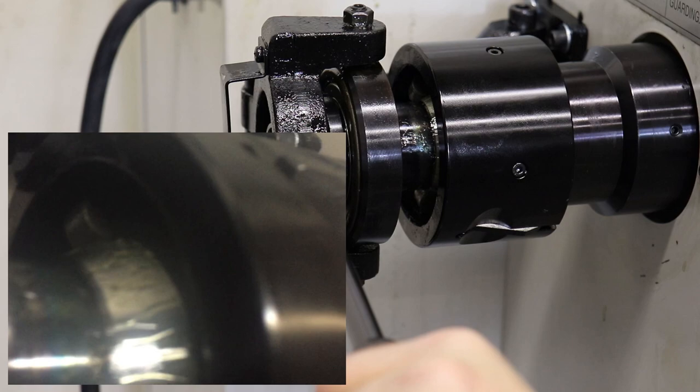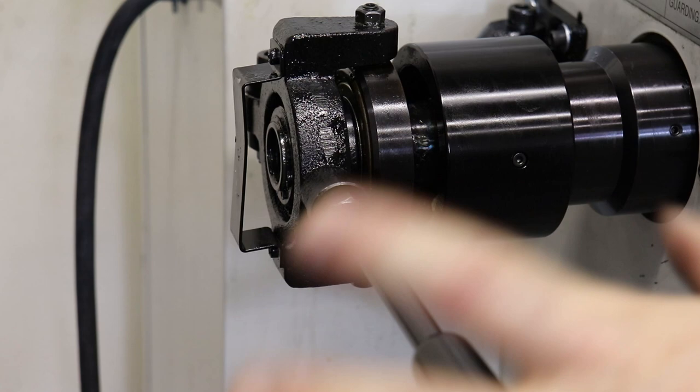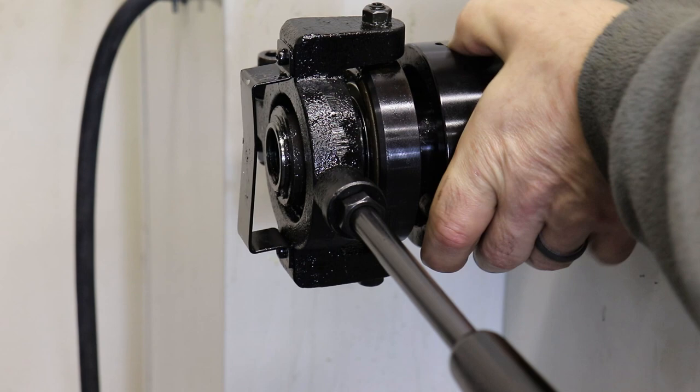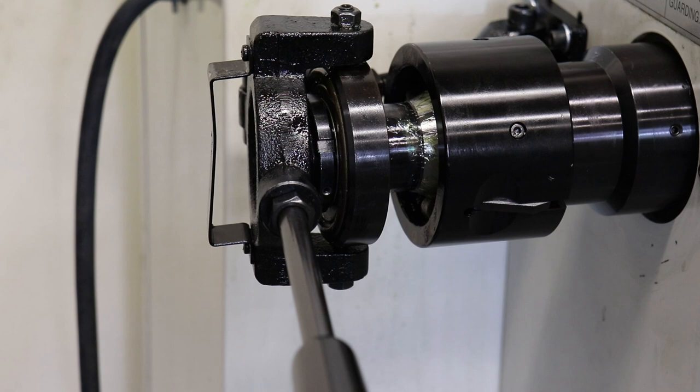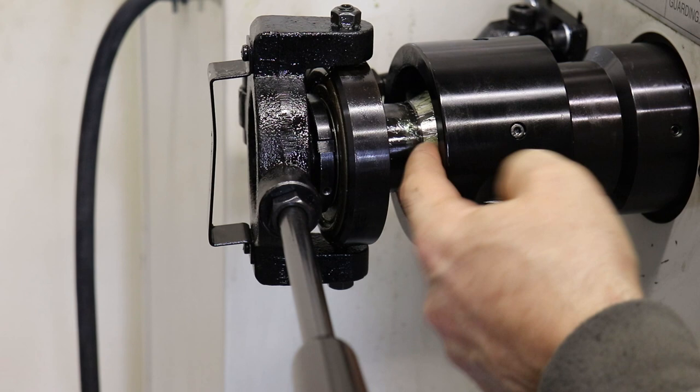So now I'm gonna pull it in a little, and then loosen the draw tube a little bit, and then I'm basically feeling for the right feel and sound. So let's see what happens. So that was too loose. So let's tighten up the draw tube a little bit. And there, that felt pretty good. And you can hear how basically the three spring-loaded cams snap past the top dead center of this kind of cone shape inside of here.